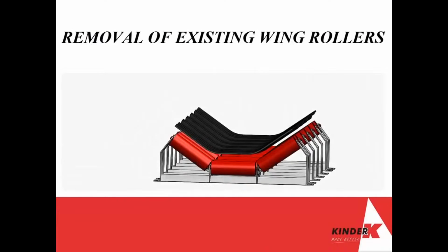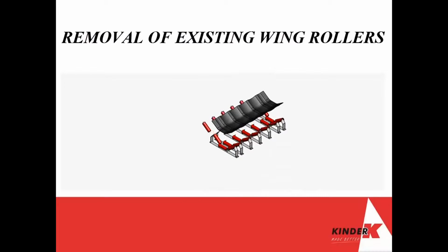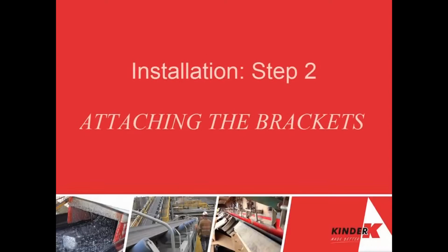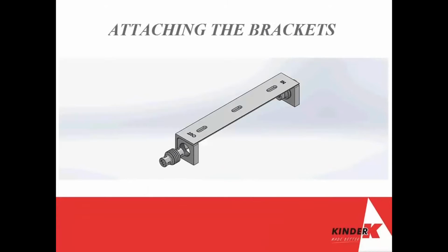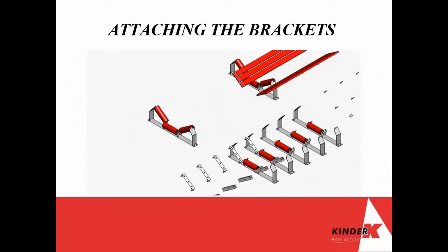To commence installation, first remove the existing wing rollers from the idler frames and replace the wing rollers with the adapter brackets provided. Then, adjust if necessary the end shafts to suit the roller diameter and seat the brackets into the idler frame slots. If required, you may also like to attach the retaining plates.